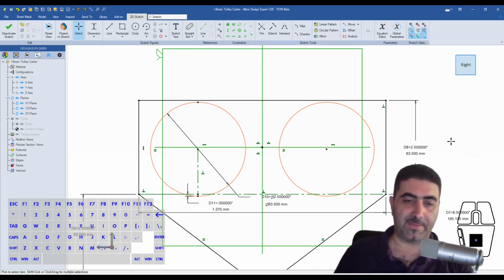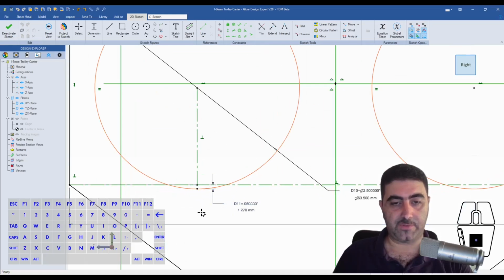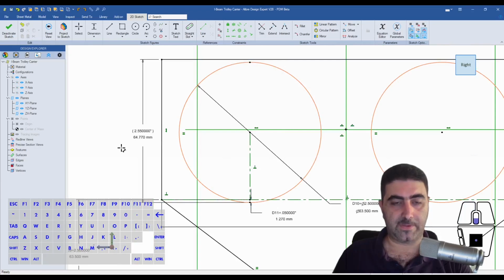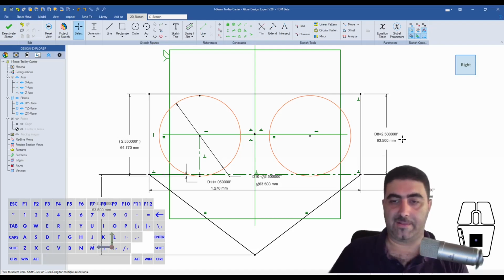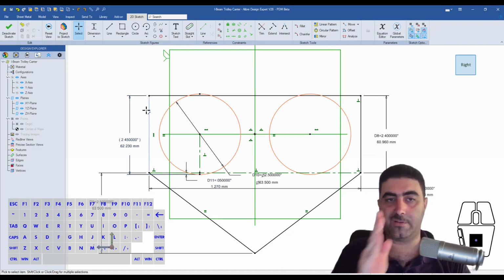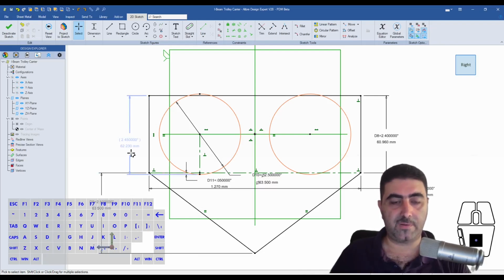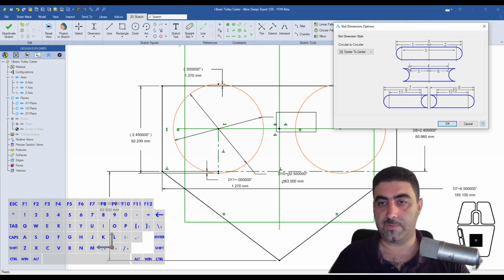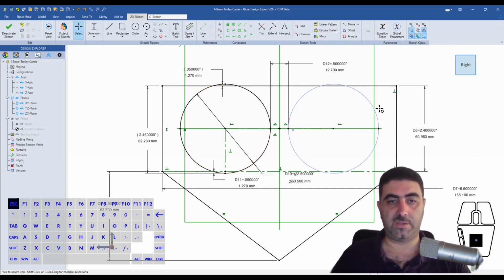Okay, but look at what happened now. If I dimension from this point, which is the point of contact, up to this top line, okay, I get 2.55 inches. That's pretty close for comfort, right? I don't like that. I don't want to be cutting it that finely. So I'm just going to make that 2.4 inches. And now this flank of my carrier, first of all, is inside the free space of the I-beam, and it's got a bit of room, right? And I also want to have, I want option number 4 here. I also want to have half an inch here.